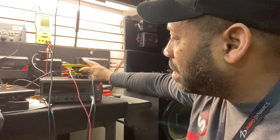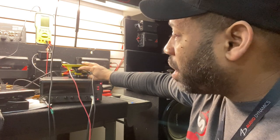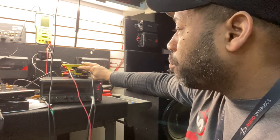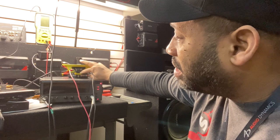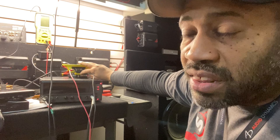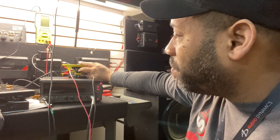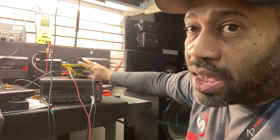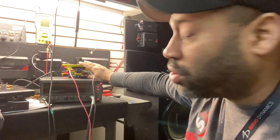What we were doing is converting it to a regular first order 6 dB crossover by removing the coil. The coil is ran in parallel, so if you remove the coil, the tweeter will still play because the tweeter still runs in series with the capacitor. This is where we got into the debate yesterday — the person said that if you remove the coil, the tweeter doesn't play at all and it just becomes a regular mid-bass driver with no tweeter, no longer a coax. That's not true, and I'm going to show you now.